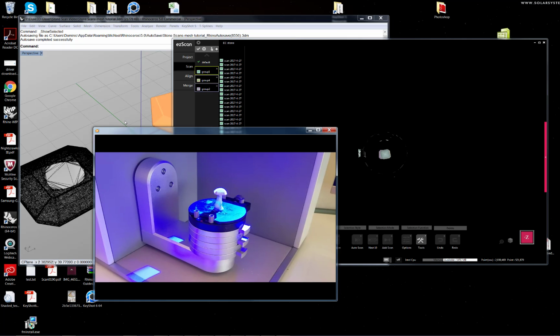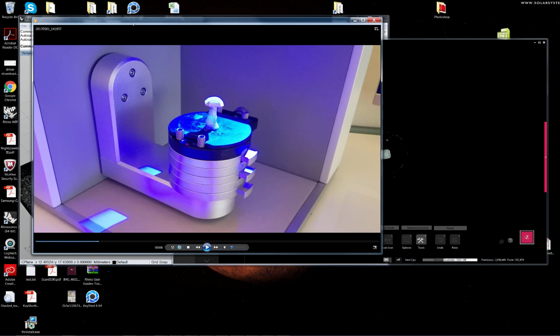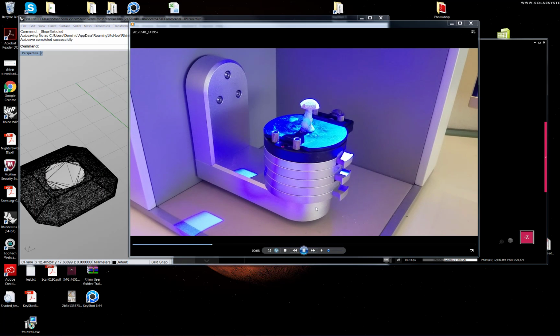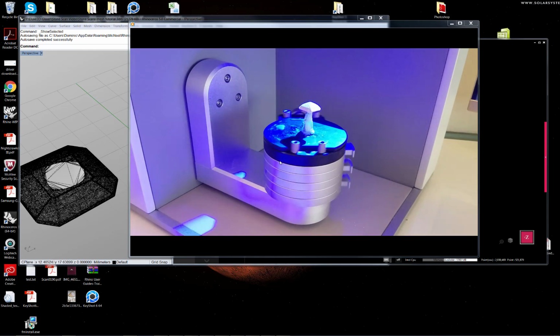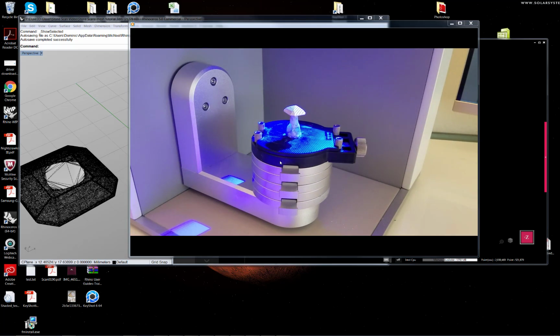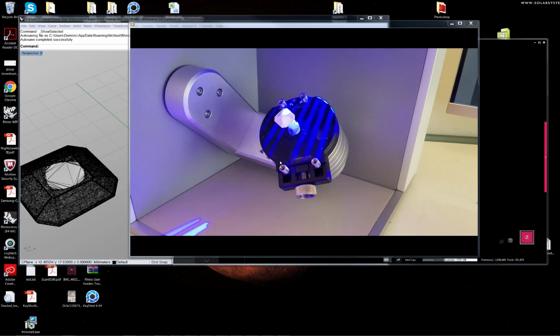Right now, I'm going to bring the video here, and let's take a look at this. This is a scanner in action. What you'll see here is a series of bands of light that get projected onto the surface. There are stereo cameras in there that look at that with parallax, and they plot a point in three-dimensional space on that surface. And that's how it's capturing the data.